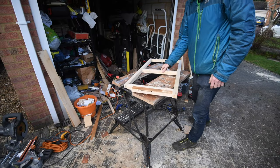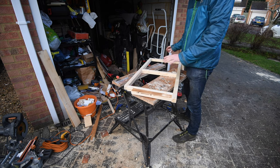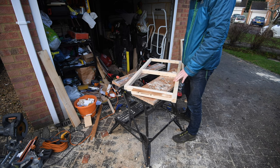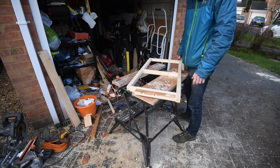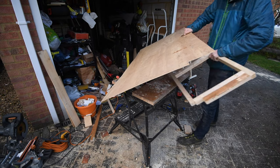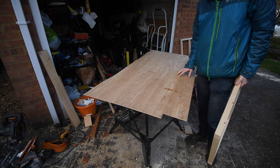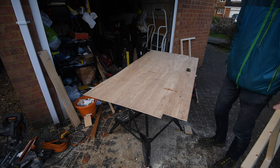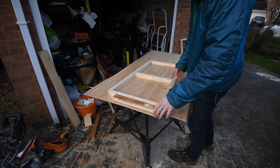The cupboards will need shelves inside, especially the two main ones which have pumps and batteries underneath. I'm using some spare timber to make a little frame and then I'm going to put some 5mm ply in as the shelf. I'm reusing some old ply from my old van which has got marks on it — it was a ceiling piece with Christmas tree and footprint marks on it — but at least it's getting reused.